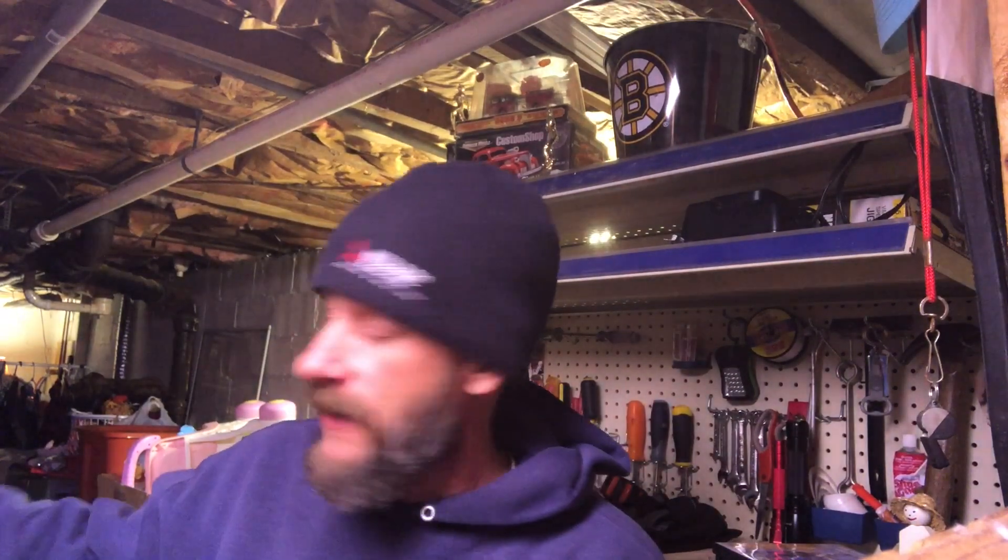I don't do residential much anymore, so I'm looking all around checking the unit and I'm like, where am I losing power? I'm losing 115 volts. Then I remembered upstairs — I don't know how the electrical code is in other parts of the country, but we have to have an emergency switch upstairs. As it happens, it's in the kitchen, and it turns out that switch was bad.